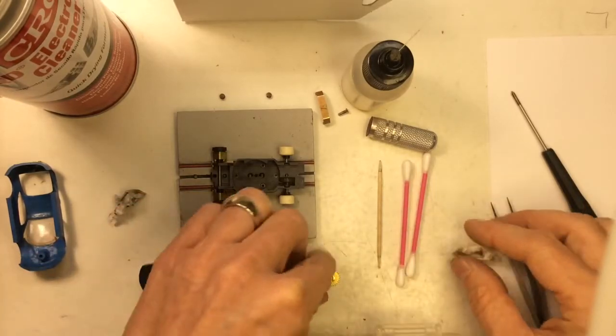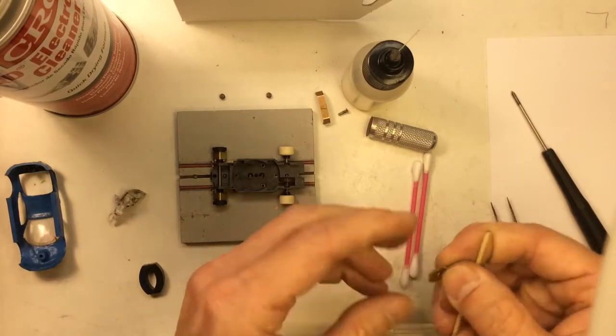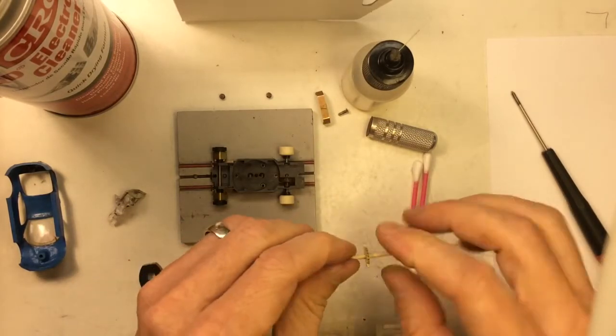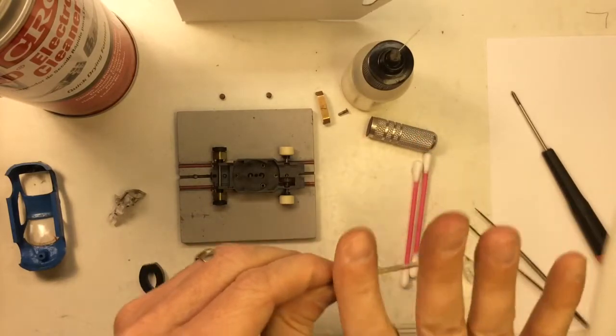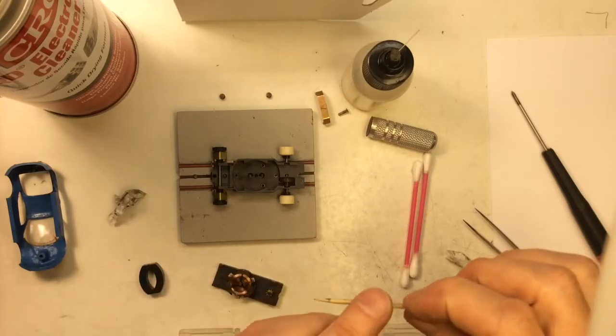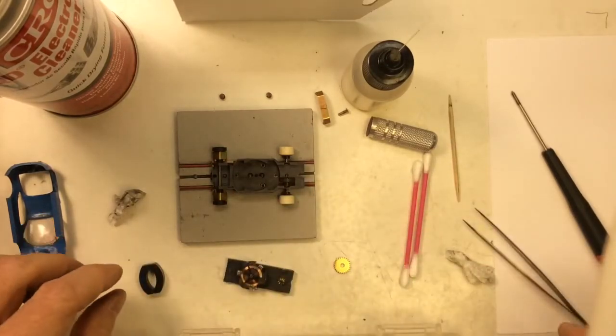Okay. Then on the idler gear, I usually like to, when there's some dirt there, just wipe it off with your thumb or a rag here. And then put this on a toothpick and just kind of gently roll it back and forth a little just to get whatever's in the bore out. See, there's some dirt in there, and that stays in there. It's going to just work as a grit to wear out the gear.